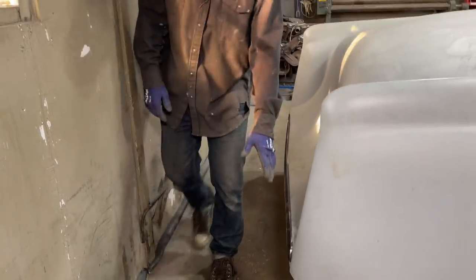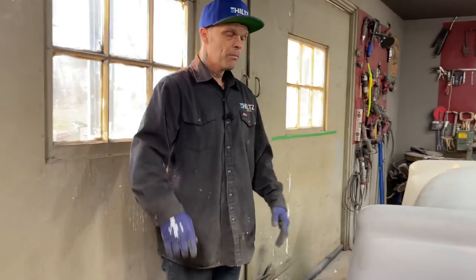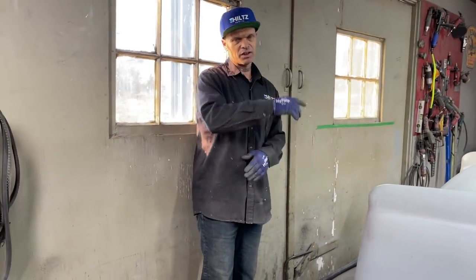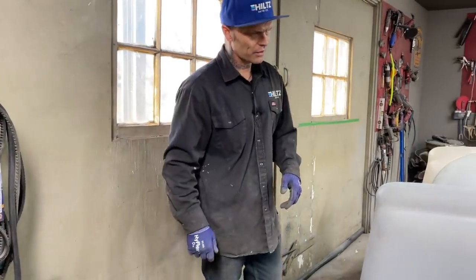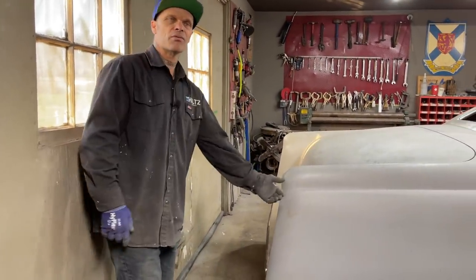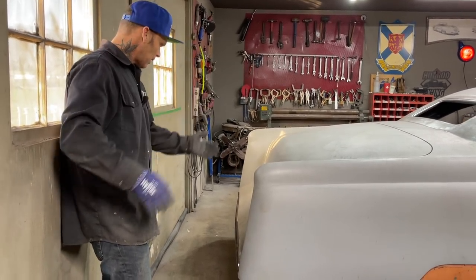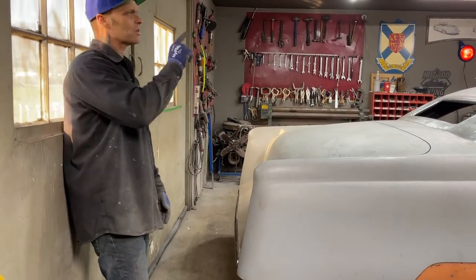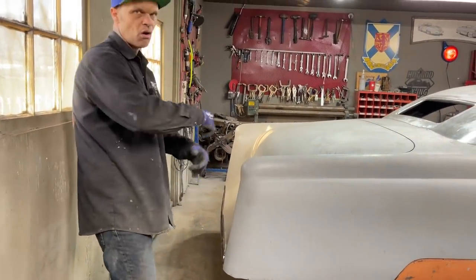I just figured that us showing you welding that in there is not something you probably want to see. But I did weld all the way around the box. I did not just spot weld it. I welded all the way around the whole thing, polished it off with the grinder, and made it look nice, just as nice as the underneath. Because when I looked underneath, it's all painted underneath there, nice and pretty and pink. And I could not put a box underneath there with spot welds. Couldn't do that. So I welded it all the way around, ground it all off, so it all looks nice.